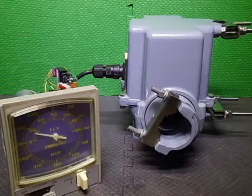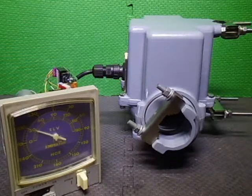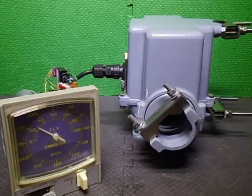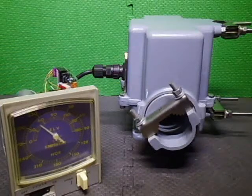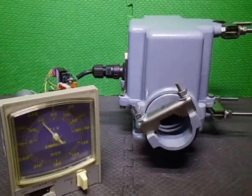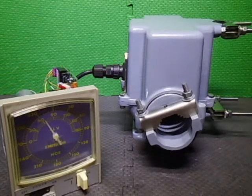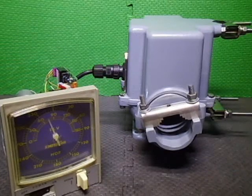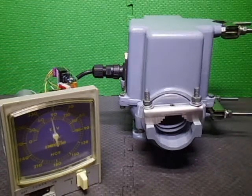The DC motor in this runs fairly fast, but this design, this particular rotator with the AC motor, it would have been really, really slow, because AC motors don't spin anywhere near as fast as a DC. Here we come back up to 60 degrees. So yeah, with all the new gearing and everything in here, this 95 seconds is a reasonable thing for bigger aerials. You don't want to be jumping around too much. So there we are, back to 90 degrees.